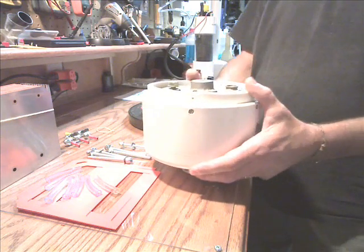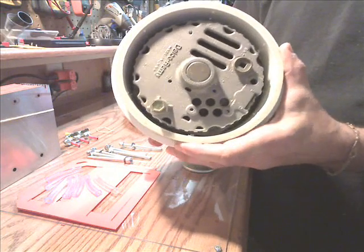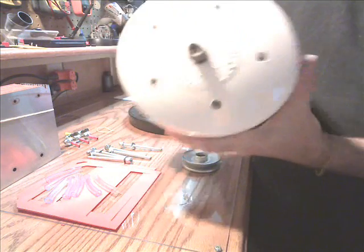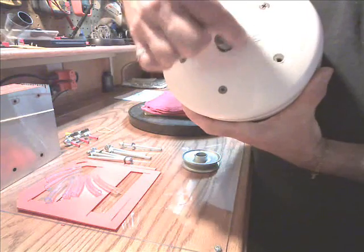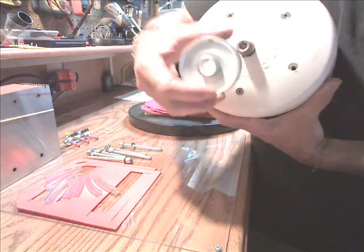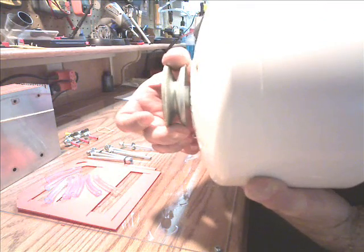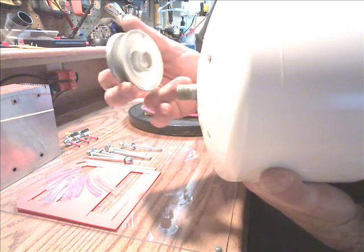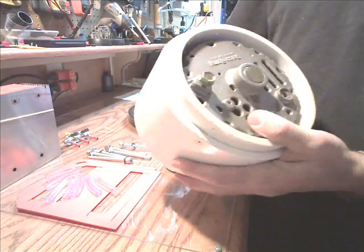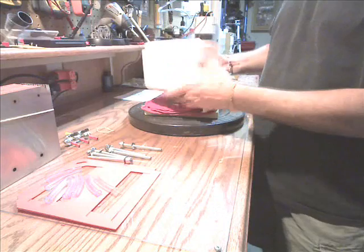I have been working on the windmill. There's the alternator mounted inside the hub — there's the front of it. Now I have to make this hole bigger right here. This hole has to be bigger and I'm going to have to put a bushing in it, because when I go to put the props on there — this is just the pulley that came off of it — obviously you don't want it hitting the casing. So I've got to put a spacer in there. I have it mounted in there. It's getting close. This is the front half of it.